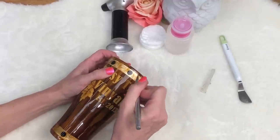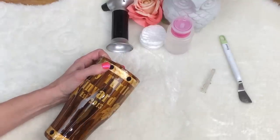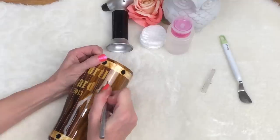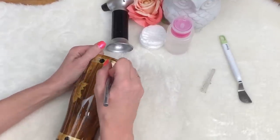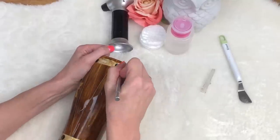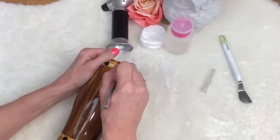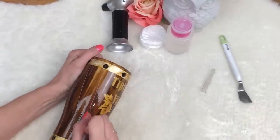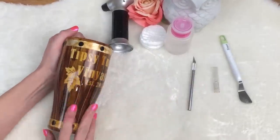So I'm just using a lot of pressure and scoring down the cup. This cup has about four layers of epoxy on it — layers of epoxy between the two colors of the wood, and then layers of epoxy over it to make it shiny and beautiful on top. I'm just pushing really firm and scoring down. We're going to do this multiple times. The scores don't have to be any certain length or width — it's just giving yourself strips to work with.